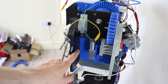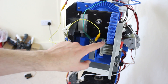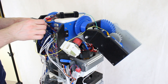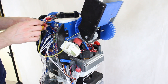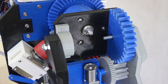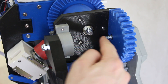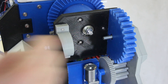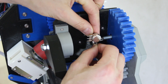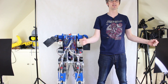It's all mounted up. I've left quite a bit of space in here, which allows me to put a bigger motor or a planetary gearbox in if needed. It seems to work pretty well with quite a wide range of movement. The reason those shafts don't go all the way through is so I can put feedback pots in there in the future - one will fit from each side. I've off-centred them so they don't share the same axis; one is slightly lower so they don't get in each other's way. I'll need to make small mounts and couplers to attach those shafts to the pot shafts.